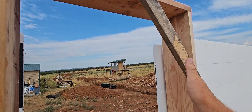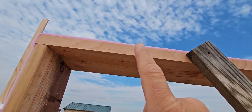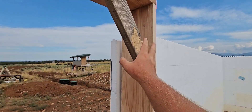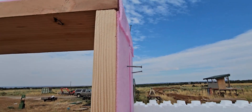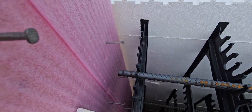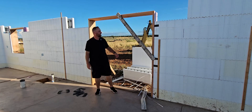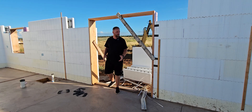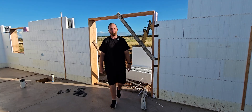I made sure to plumb both uprights in two dimensions — one on the face plane and one on the side plane. I set a level across the top to make sure it was level. The diagonals are what's holding it plumb. You can see those nails protruding out, and going down inside the block there are more nails that will bite into the concrete. We got them done. Now we go to the home center, buy our windows and doors, slip those into the bucks, nail them off, and enjoy your new door or window.